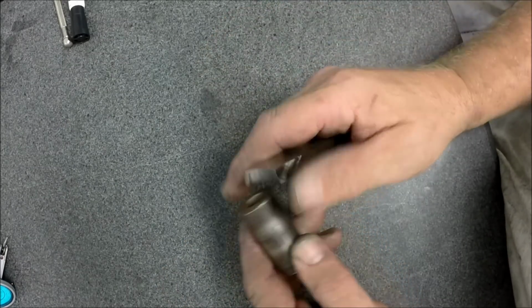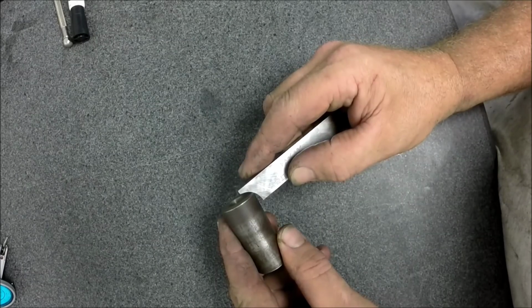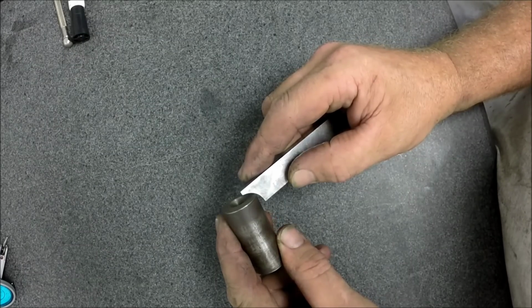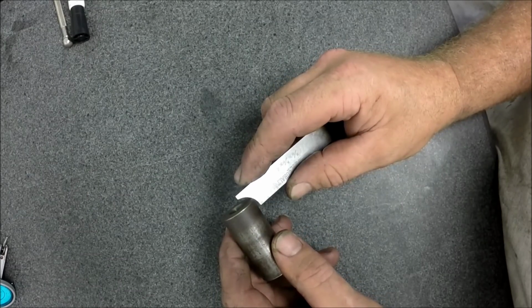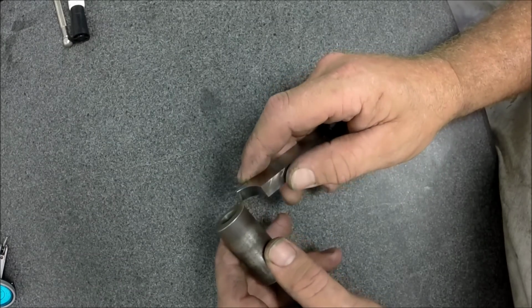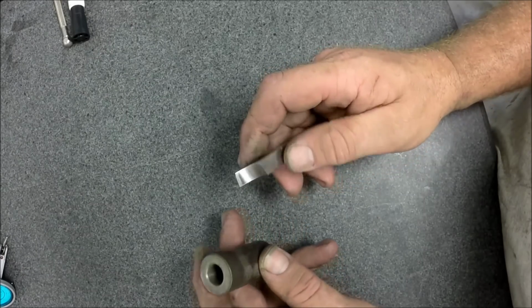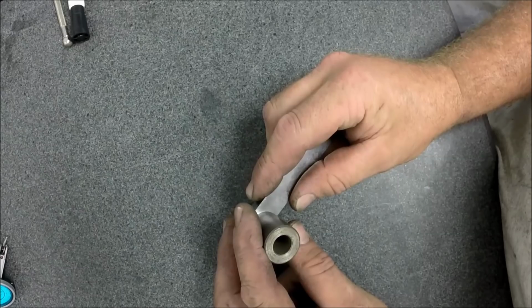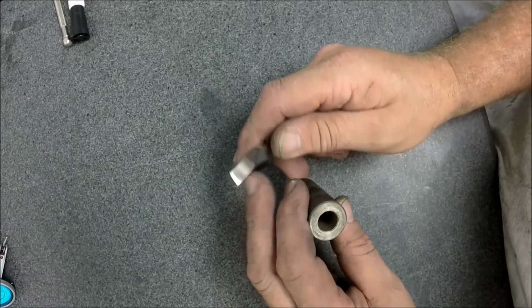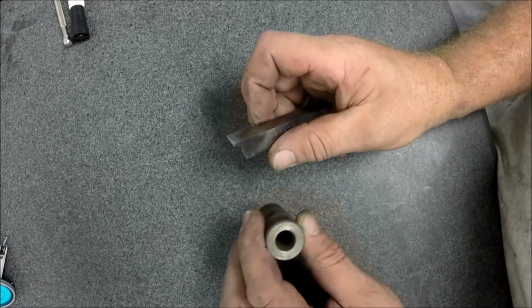You know, maybe we'll even cut this piece and see how it does. The grinder's already set up. All I gotta do is throw it back in, and if I kill the tool, all I gotta do is regrind that. So 15 degrees was our choice. That's a good all-around back angle. And let's go try it.